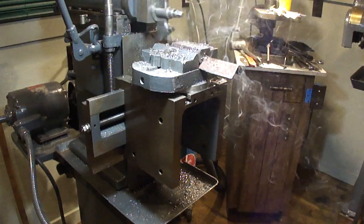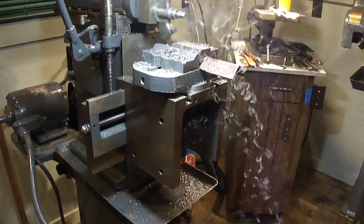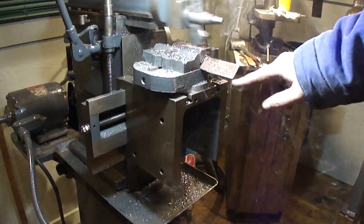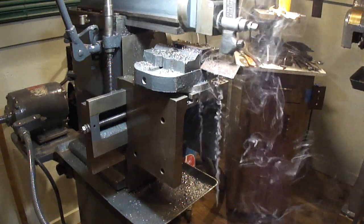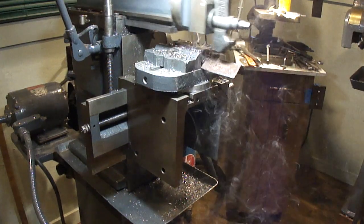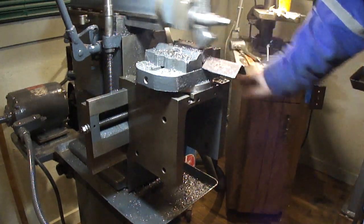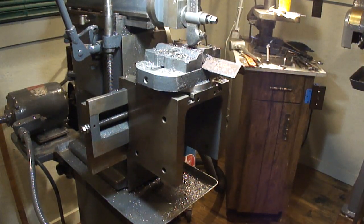I was having a little trouble getting the V-groove exactly parallel to the bottom because of the tapered feature, so I took a piece of angle iron and machined it perfectly equal on both sides and just stuck it underneath to act like a triangle parallel. I'll cut the bottom off here, then flip it and do a facing cut on the top. I'll set the speed down and do a finishing pass with a low step-over so it gives a good finish. Okay, I've got it faced off.